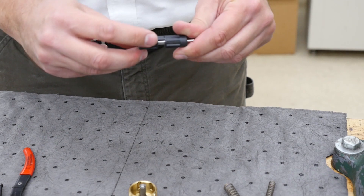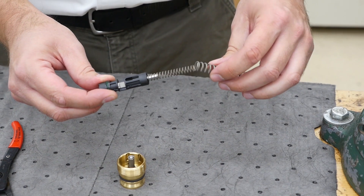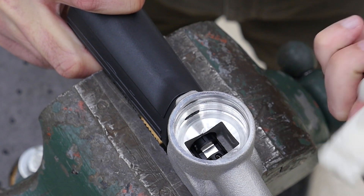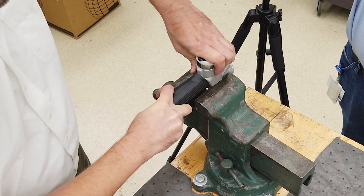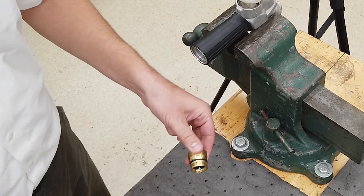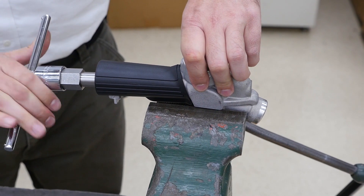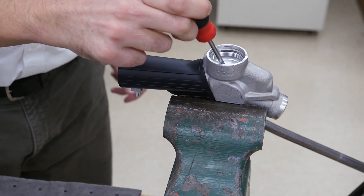Using a light assembly oil, lubricate the o-ring. Next, slide on the smaller spring followed by the outer spring. Insert the stem assembly into the nozzle body. Using the stem hand press, push in the stem assembly until you can see the groove whilst looking down into the diaphragm opening. Place the stem stop block into the diaphragm opening and into the groove, then slowly release the stem hand press leaving the block in the groove. Lubricate the o-ring on the valve assembly and install it into the nozzle body. Using the T-handle wrench, tighten it until it is snug and remove the stem stop block. Use a small screwdriver to ensure that the stem is properly aligned.